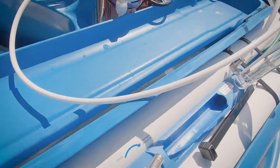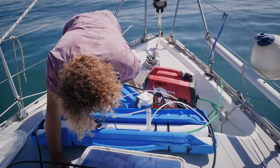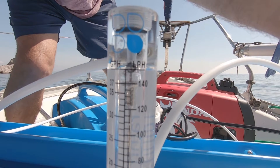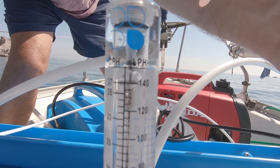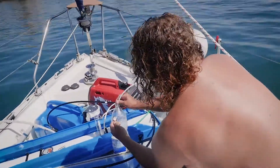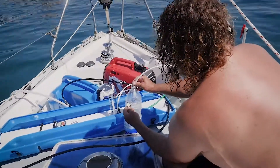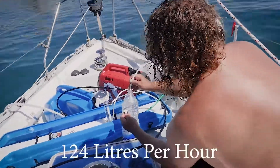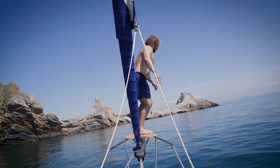This can be changed — if in brackish water, you might not need as much pressure. So make sure that your flow gauge is not exceeding 35 gallons per hour. Here you can see the flow gauge showing around about 35 gallons per hour or 135 litres per hour. Here we filled a 2 litre container which took a total time of 58 seconds. This is an impressive 124 litres per hour.